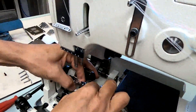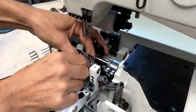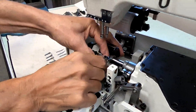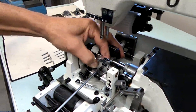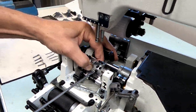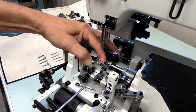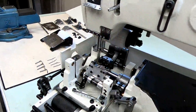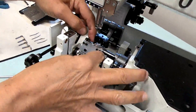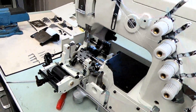Get my finger on that other nut. Those nuts might fall out but no big deal — just get them out and put them back in. I'm not going to tighten these all the way yet because we still have to set the looper. Snap it back in place. You can see this looper rocker has elongated holes in it so you can move it back and forth — we'll have to set that.